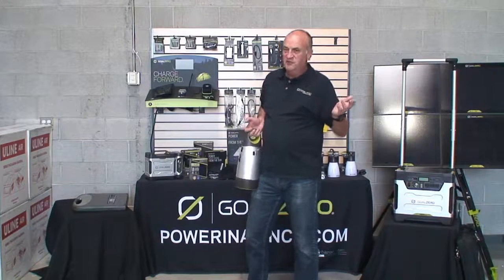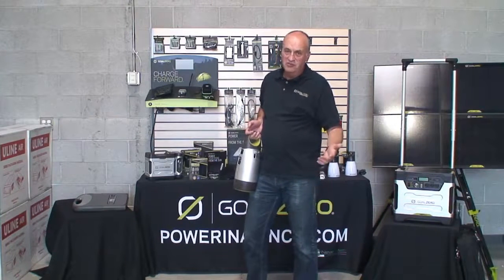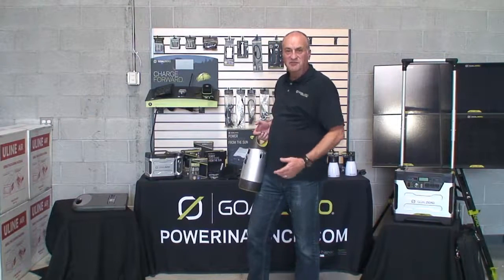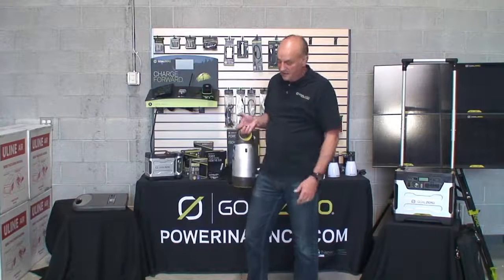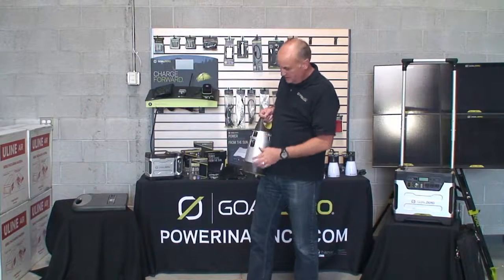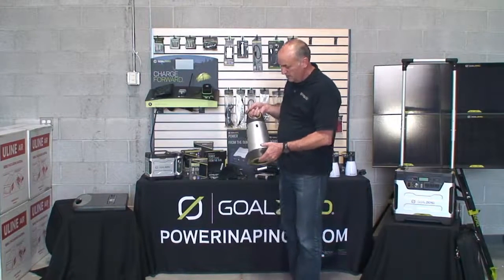lights, and it only went about 9 hours. And I couldn't figure out why, and it's because I had the inverter on, so it was drawing power running into thin air. So keep that in mind. You've got to be aware if the inverters are on or off, because they will take power even if nothing is draining it.